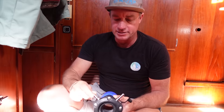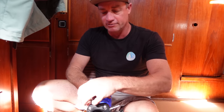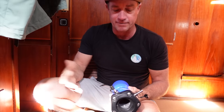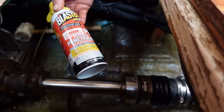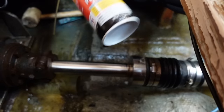These water inlets here supply water to the lip seal so it doesn't get too hot. I'll be taking water from the engine — it comes through the raw water pump, pushes through the engine, and then the excess flows back through here. Obviously through a vented loop so we don't have any siphoning of water into the engine. There are two inlets on here but I only need one — the second is designed for a twin-screw setup. I'll probably just put a T or cap one off. All these bolts have had penetrating oil soaked on them a couple of weeks back and again today, so by the time I get to them they should come off pretty easily.